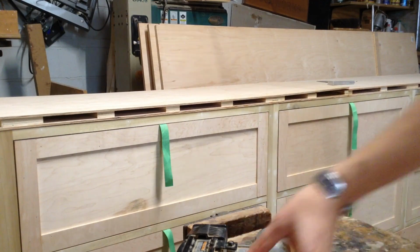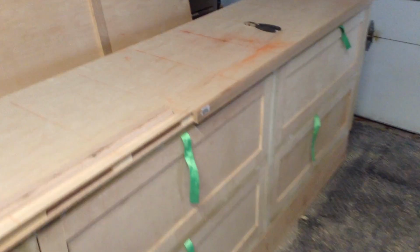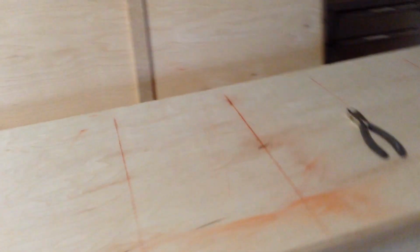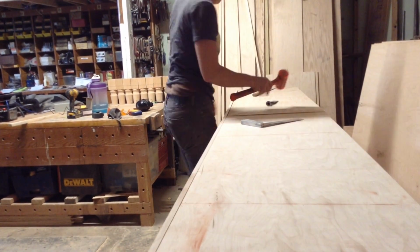Like I said, my seams are lined up so that the foot of the shelves, which I'll be building next, will fit in place. And then you can just see, because that plywood's set back a little bit, how that maple trim will fit in place. And that turned out perfectly. I could hammer it in there. It's a nice tight fit, which is what I want. And then this can just set in the shop.